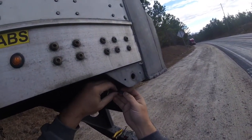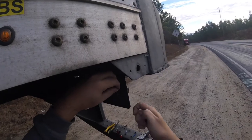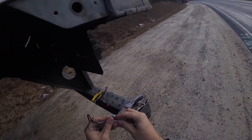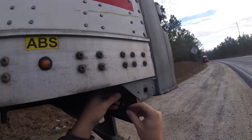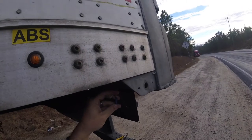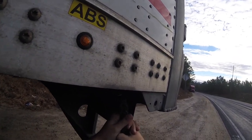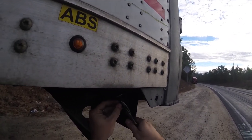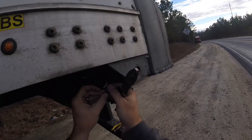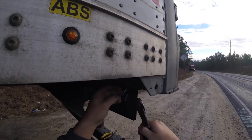So these connectors here are self-explanatory — just twist the wire pretty good, get it nice and tight. Make sure you get it in the small end because the big end is obviously where it plugs in. You don't want to put it in this way and then crimp it — then you're done, you're toast. Crimp it, die, good. Give it a little snug — all right, we're good there. Same for the other side.